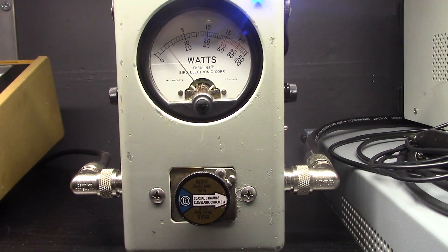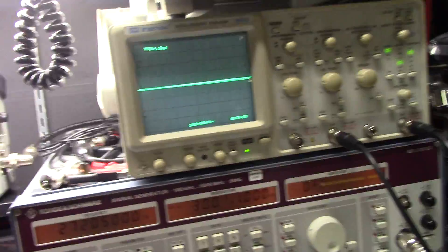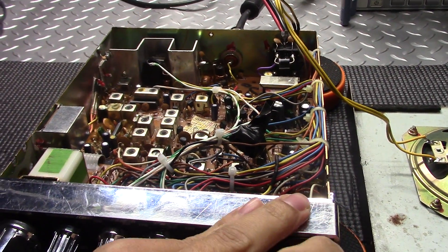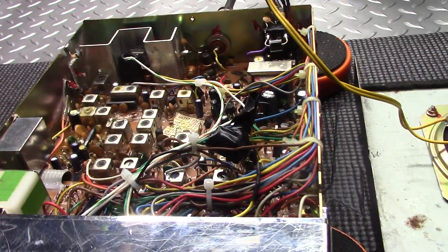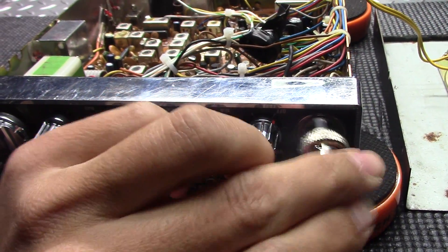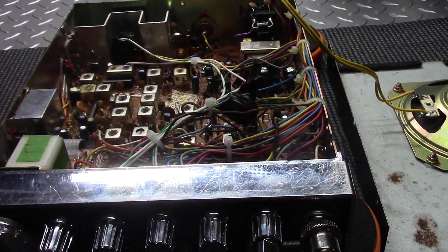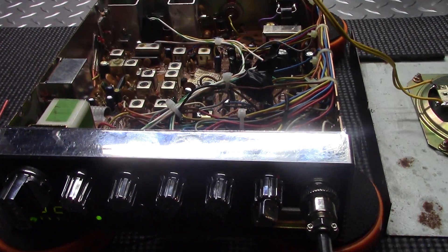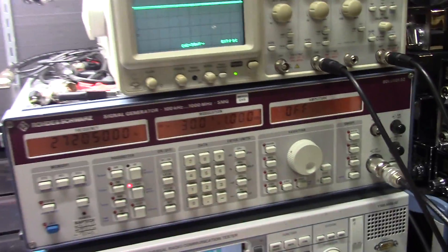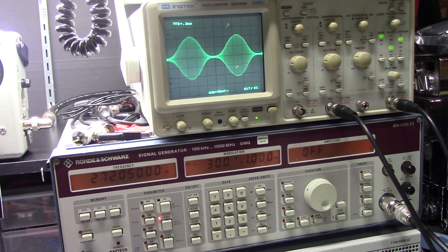With that being said, let me quickly show you what I got out of doing this simple MOSFET conversion. Audio one through five — over 30 watts on a 50-watt slug. Most guys would stop right there. But generally nobody shows it on the scope — or if they do show it on the scope they're just talking into it and the waveform's jumping all around so you can't really tell what it's doing. I always steady the waveform for you guys. There it is: MOSFET conversion, beautiful waveform.